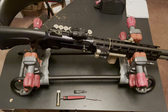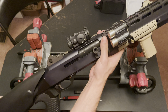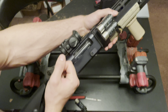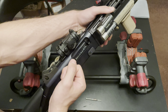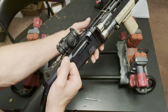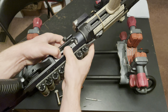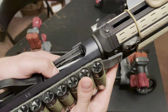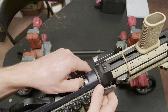The first thing you want to do is unload your weapon. If you have a round in the chamber, go ahead and pull that back and let your round fly out. I have one on the lifter, so just hit that, let it go forward, and have your second round fly out. To get them out of the tube, you're just going to push your lifter down. That is the old round retainer clip right there — just push your lifter down and push in on that clip.